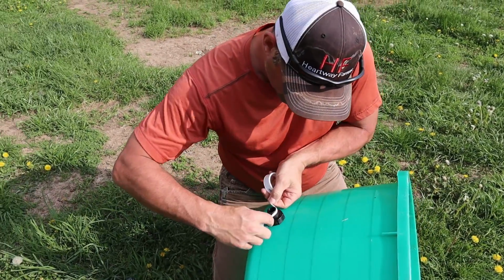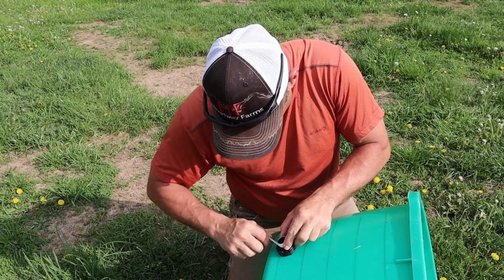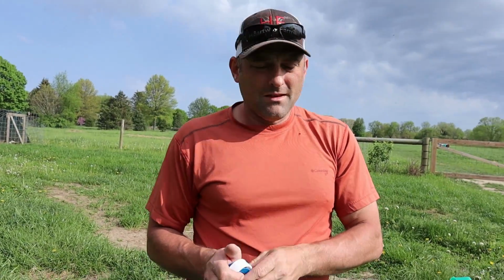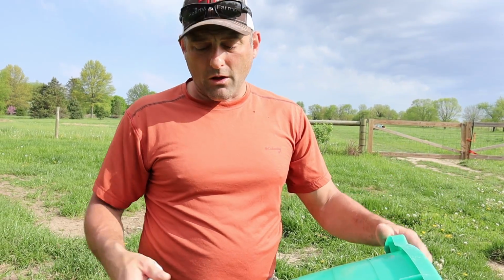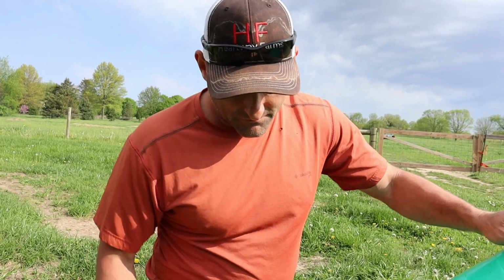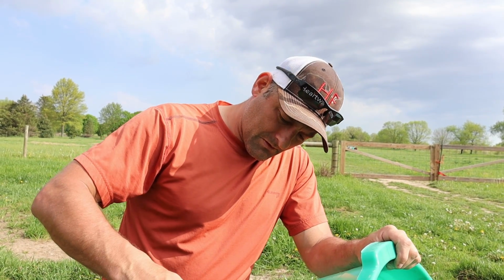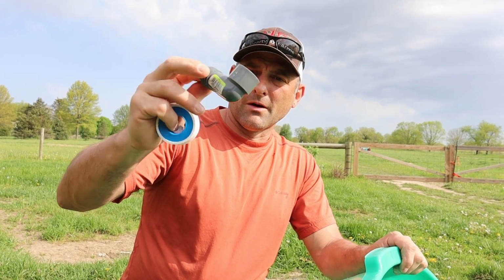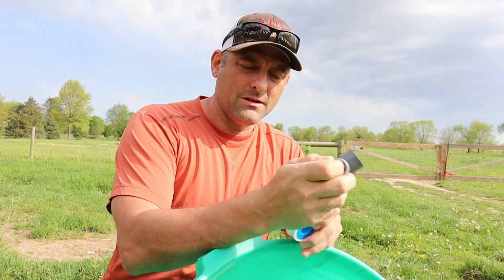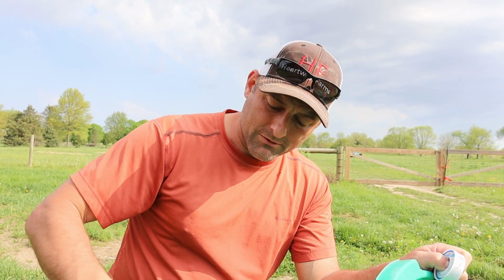Right, so I'm just gonna throw some Tuff Tape on the outside here. And I think that this works under gravity. So just basically gravity PSI, or actual like residential or well pressure PSI, because we're gonna experiment with both. We know it works with our well for sure, like with our hydrants and stuff outdoor, but you wanna experiment. So I'm just using a barb connection on here with a threaded side to screw onto it, because we're gonna put 1-inch poly pipe into here.